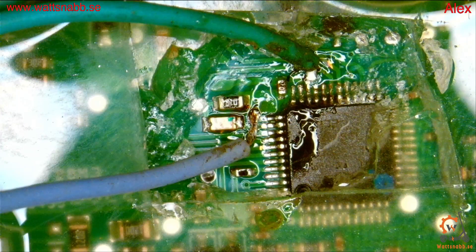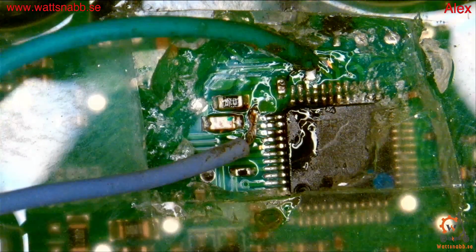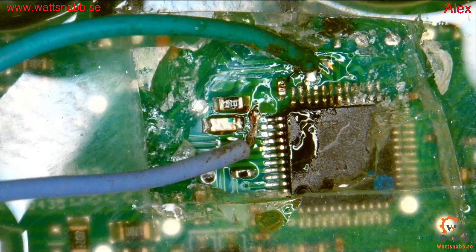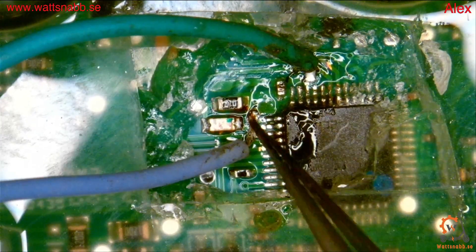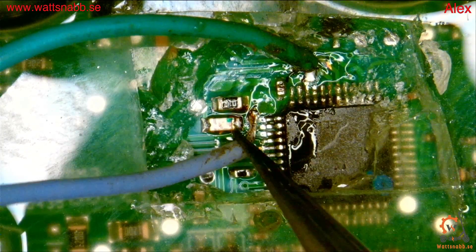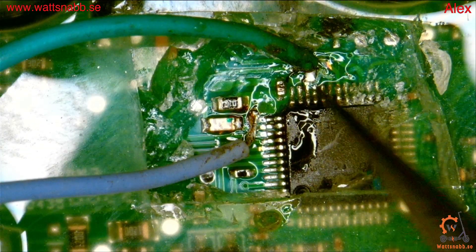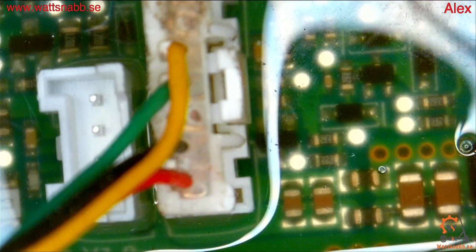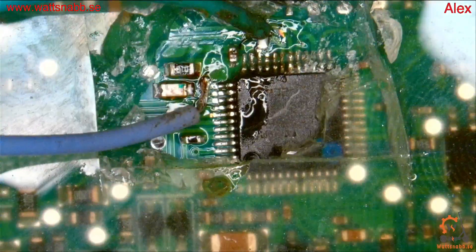I will try to flash this, and if it's not flashing — if I have a bad connection — I will just re-solder these connectors. To go through what I have done: SWCLK here, SWDIO here, and then I connected my connector here with 5V and GND. I only need to solder two pins on here.